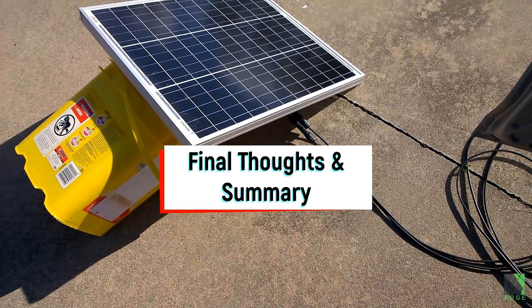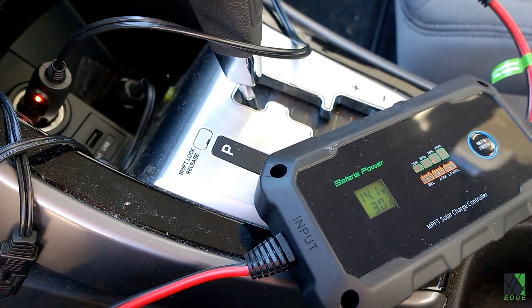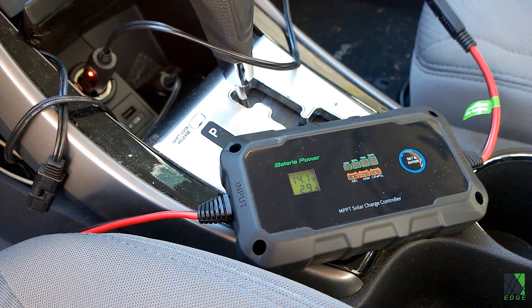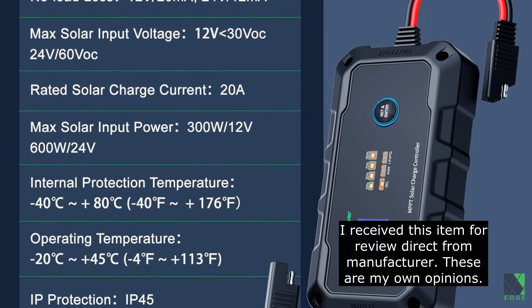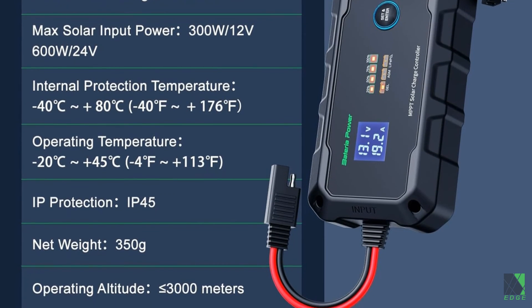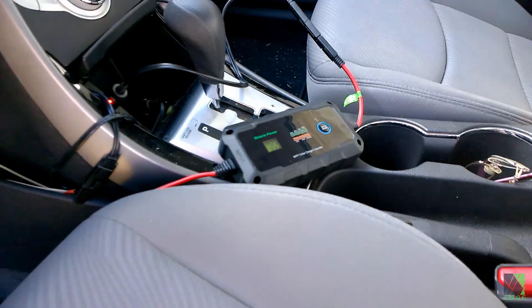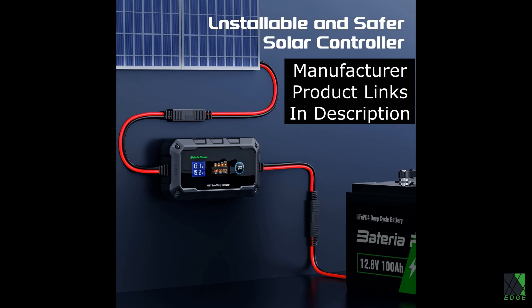This charge controller reminds me of one of my favorite automotive battery chargers, except I can use solar power instead of grid power. I would not recommend attaching battery clips though, because it would be too easy to connect the charge controller backwards and potentially burn it out. A quick summary: the MPPT functionality worked great, I couldn't find any reason to complain. It's great for grab-and-go charging in the field with the proper cables and connectors. The one-button interface is convenient for quickly changing battery type. The SAE connectors can be confusing — always pay attention to polarity. In short, I can recommend this charge controller for small setups and mobile grab-and-go charging. Based on how it performed, I think it will get quite a lot of use around here. If you want to buy one, the link is in the description.